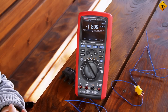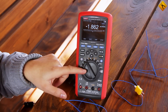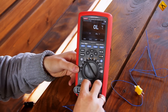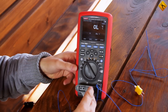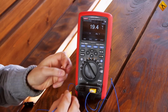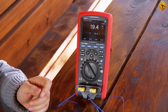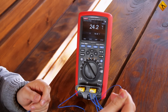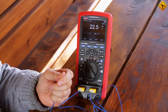As mentioned before, this multimeter can measure temperatures in a two-channel mode. Let's demonstrate this. Turn the knob to MV and press the select button. The temperature measurement mode is now active. Now we'll connect the adapter and plug in temperature probe T1. A temperature of 19.3 degrees Celsius is displayed. And now temperature probe T2. Both temperature probes show 19 degrees. I will hold T1 with two fingers and the temperature should go up — yes, it does. Letting it go. The temperature of T2 also starts to rise.